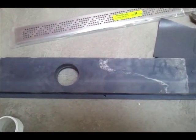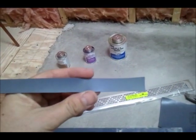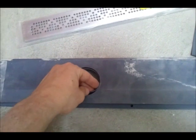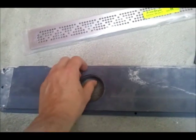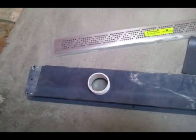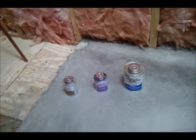But if you take a strip of the PVC rubber liner and cut that, it will fill that space very nicely. So you use that as a PVC shim. The next thing we'll do is glue all these items up. So that'll fit very tightly in there. We'll glue all these up, let them cure with these various products over here. Makes a watertight seal.